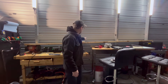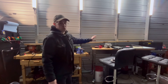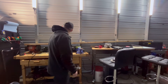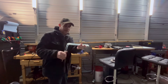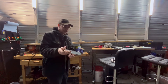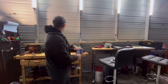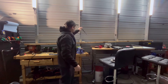So in the shop I'm going to put this shelf up. As you can see it's pretty long — actually 12 feet long by about a foot deep and two inches thick. I have four of these heavy duty angle brackets. They're 10 inches, got them from Lowe's, and they're quite strong. The four of these in the studs will hold this up perfectly fine.